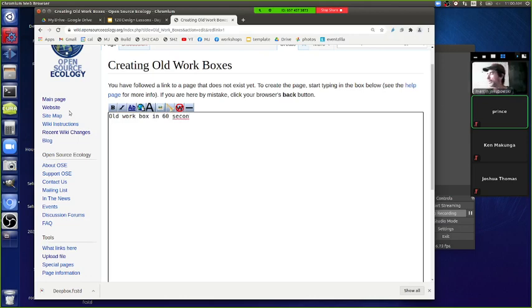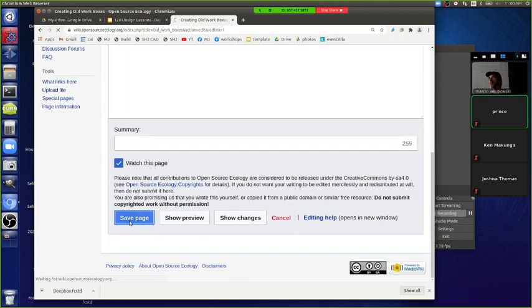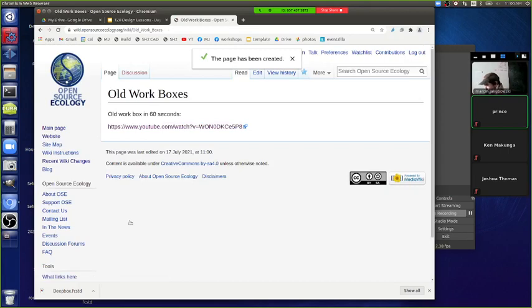From the top of the blocking. We also change the orientation. It should be vertical, because outlets are typically vertical. Actually, if you have an old work box, I don't think there's a requirement for it being vertical or horizontal, but vertical is pretty standard.